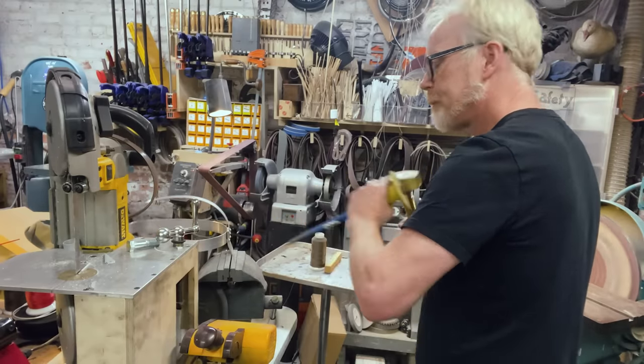So I'm going to hit this on my belt sander and rough it all up here. I'm not going to sand through the rivets. I'm going to rough it up and it'll give lots more surface area for my epoxy to grab. That's what I'd call toothed up.